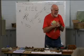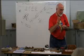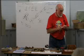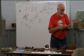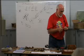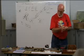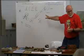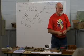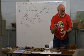That's just wonderful. As I say, I have taught engraving to people who are specifically interested in woodblock printing, and some of the people who took part in my class were experienced woodblock makers, and they were really there to see what I was going to say about it. Some of them were a little bit affronted that I ground a shoulder into the tool, because they didn't do that. It was just a cultural tradition amongst woodblock engravers that they used the blade as it was bought.